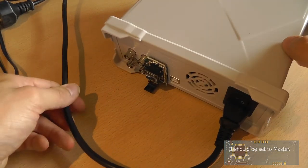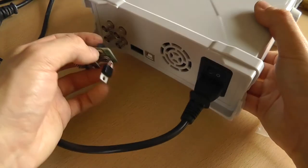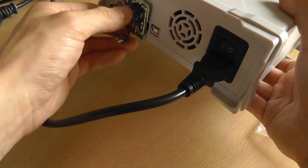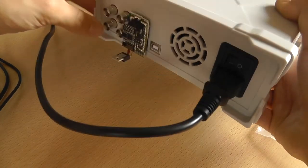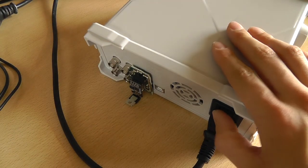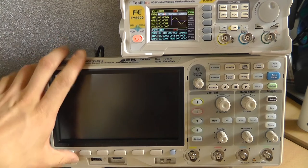And my guess is that there will be a voltage on the thing. So it turned out that the 3.3 volt regulator was, well, bad. They were all bad. So I managed to find another one, but it didn't match the pinout that I used. So yeah, here goes nothing. That's a good sign. So it's connected.